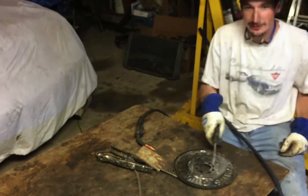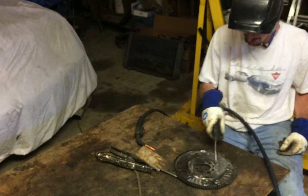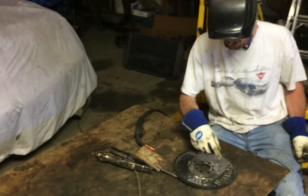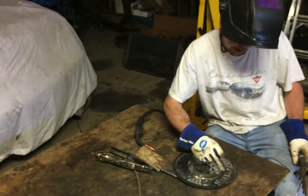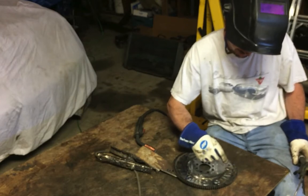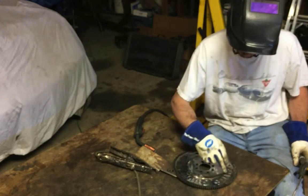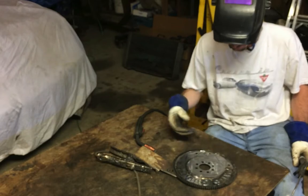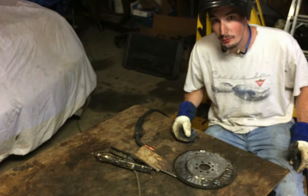Pretty good, but I got a little jiggly in the middle of that one, so that's something you want to keep the piece comfortable so that you're not jumping around. And one other tip is, like making this A and stuff, you want to come up and down and then go back up right away and add your cross before that area is cooled, so that it melts in. And you kind of want to plan things like that so that they're kind of melting into the hot weld.